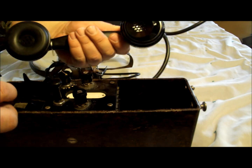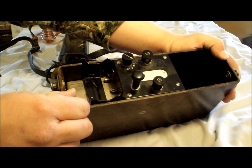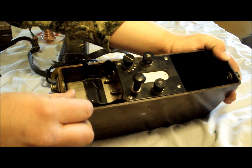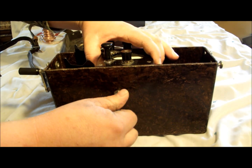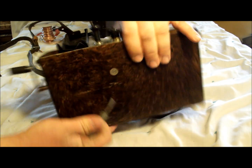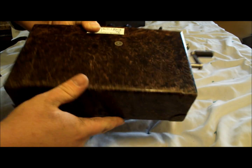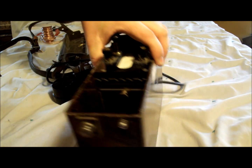On these Ericssons, on this side you'll have a tool — this is your little screwdriver. Just unscrew that, and that's going to give you access to the phone if you need to take it apart. There are a couple of screws on either side. Pull your handle back off and you can pull out the whole component if it needs to be cleaned or worked on.